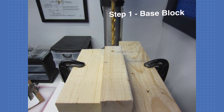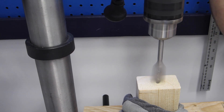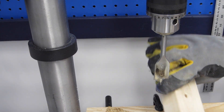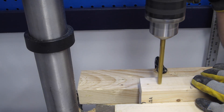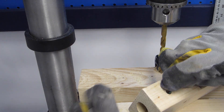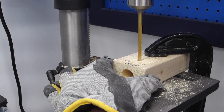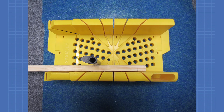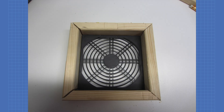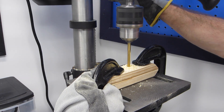This is the clamping arrangement I used to keep the wood secure while I worked on it. I began by drilling a 1/8-inch pilot hole, then used my spade bit to drill the 7/8-inch hole. This hole needs to go an inch and a quarter down, so I had to do it in several passes as it builds up a lot of heat during drilling. I then took a 1/4-inch bit and drilled down into that hole — this is the entrance for the fan wire. I tested it by passing a wire through, then drilled the hole for the power wire. I used a miter box to cut the pieces for the frame — a table saw would work as well. When finished, it created a frame that fit around the fan. I then clamped the two side pieces together and drilled a hole through the center with a 1/4-inch bit for the pivot bolt.